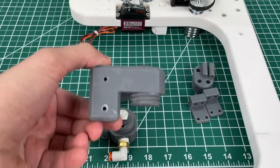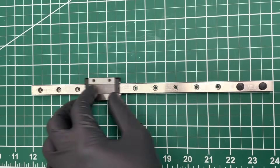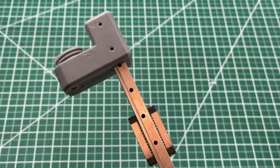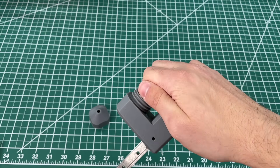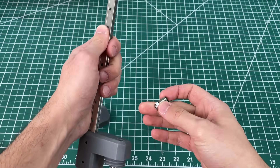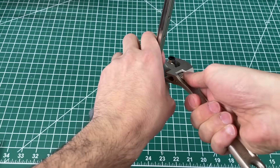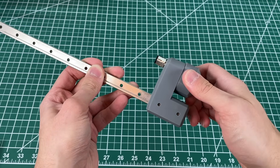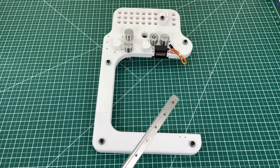We've already threaded in the nozzle and cooling system so these parts are all ready to go. This is the part that goes up and down as shown in the CAD model, and it works with these tiny linear rails which slide right into our part. We take the nozzle that feeds our brass wire and thread it onto the part, then thread in a quick connect for the coolant tube and tighten both down with a wrench. The assembly is done — simply screw on the cap which guides the coolant right past the cutting wire and we're ready to install this on the main frame.